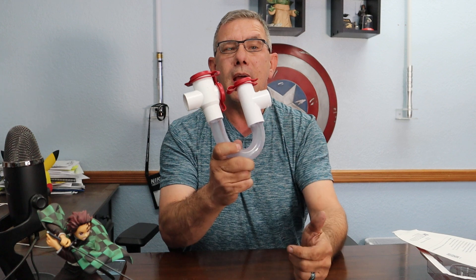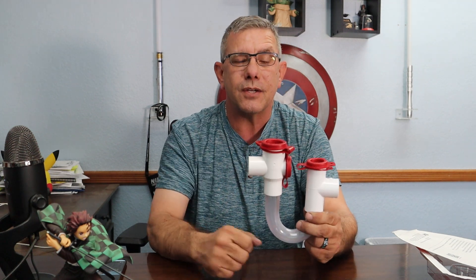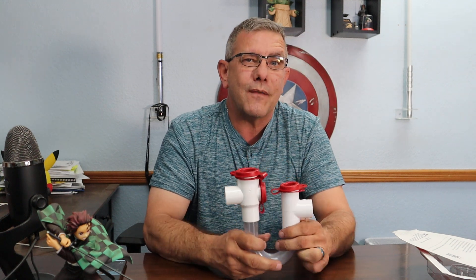I love these things — they're transparent — and I tell all my customers: if you are having a new furnace or new air conditioning installed, demand that your HVAC installer puts one of these on there. And even if you have an existing furnace with air conditioning and you don't have a transparent Easy Trap like this, when you have your monthly checkup and service, ask your HVAC contractor to go ahead and put one of these on. I would demand it. This thing can save you tens of thousands of dollars in water damage to your home and help keep your furnace from rusting out if there's some type of backup. It's a small price to pay — 20 bucks plus labor — just for the peace of mind. Demand that your HVAC installer puts one of these on your system to make maintenance easier and possibly save yourself tens of thousands of dollars in water damage.